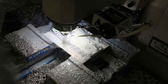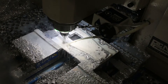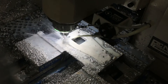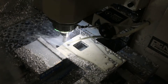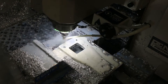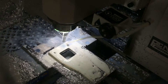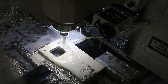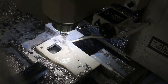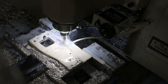Back to the end mill just finishing off that edge — you can see it's still doing the up-and-down travel at the cutter height and doing a good job of clearing chips. It would be nice to really clear behind. If you were making multiple parts with the same code, you could run a cleanup path to wiggle across and push those chips off the top of the plate. You could set the tool higher based on Z0, do a wiggle, come across the plate and push chips off to one side. For a one-off it's not a big deal, but if you were doing it a lot it would be worth it.